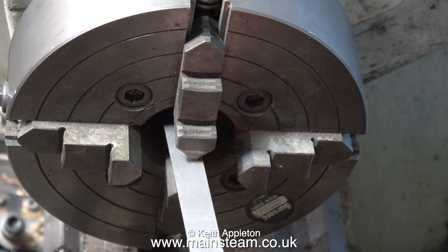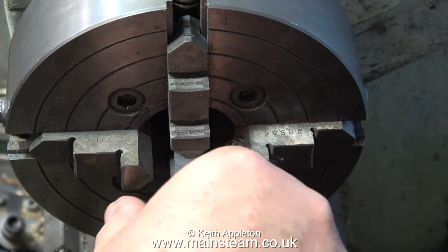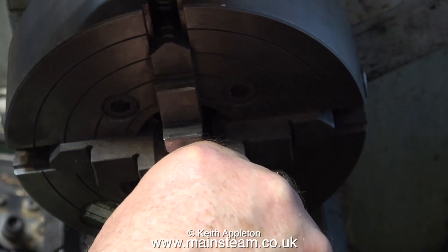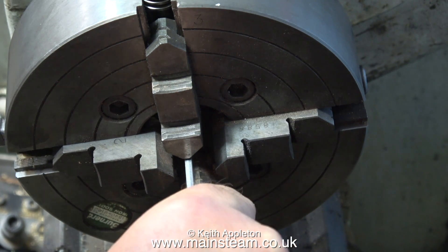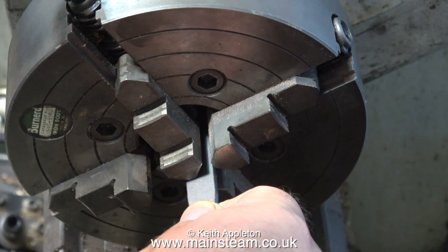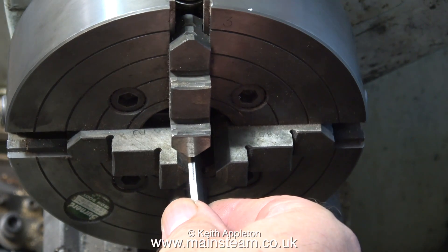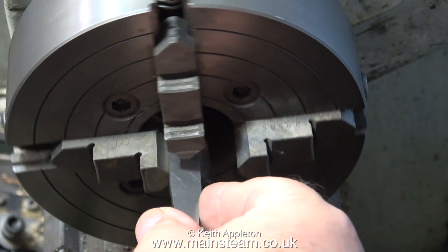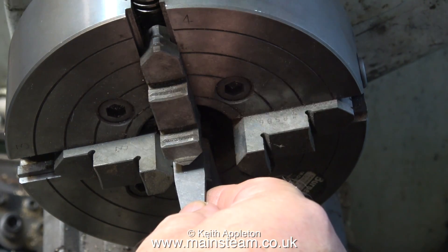Now it's time to fit the first of the brake beams into the four-jaw chuck. I'm putting it roughly in position in the middle, and now I'm tightening the jaws whilst watching the position of the jaws relative to the circular lines on the front face of the chuck. These guidelines show the position of the jaws at any time and are very useful for the initial setting of the position of parts held in the chuck — but it's only a starting point. Obtaining the correct position for the work you're going to turn needs a bit more patience and takes a bit more time. You have to make minute adjustments to the jaws to make sure that the part is exactly in the right place.